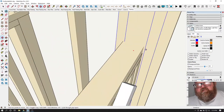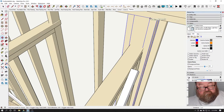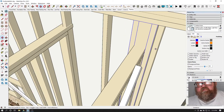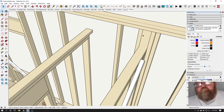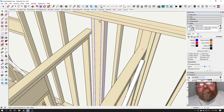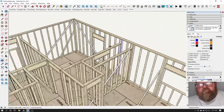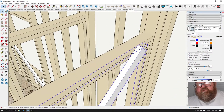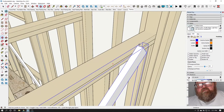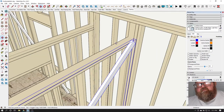There would be a T in there and it would line up with that wall. Now that the framing is correct, I can come in here with a brace along this wall because you want your braces about every eight feet on the wall.